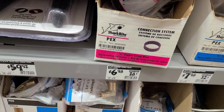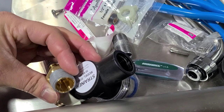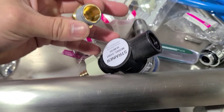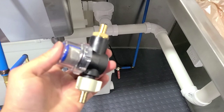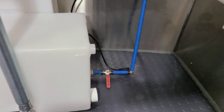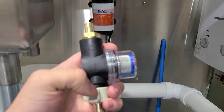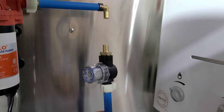We're back. We got the half-inch male adapter for PEX — don't forget to put your sealing tape on there — and now we're going to secure it into the strainer side. There it is, that's your final product on how that contraption should look. Now we're going to put it in place. Don't forget to look at the water flow arrow and make sure it goes from your tank up to your water pump — that's the direction of flow.